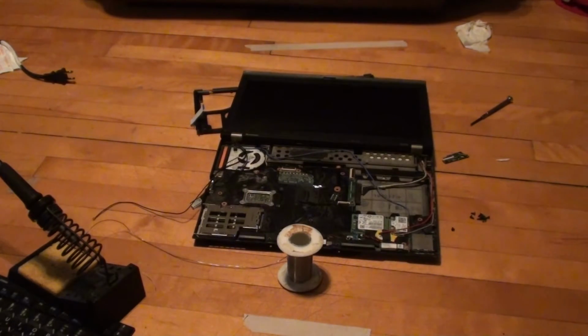This will be a hopefully quick guide on how to install nitrocaster's full HD mod on a X220. I'm using here a Weller Station WES51. I highly suggest you get a soldering iron with a pretty fine tip. The sense wire on the capacitor is quite small. I'm gonna start with this one.